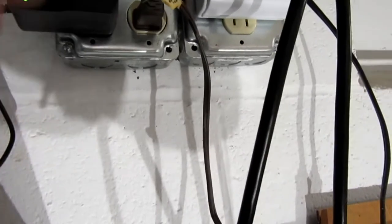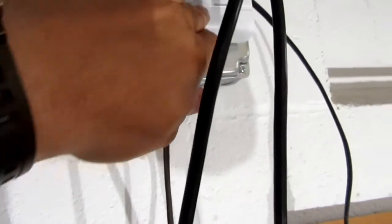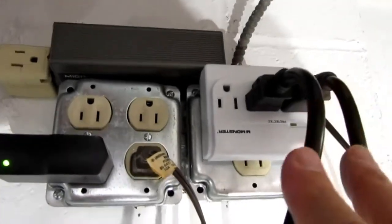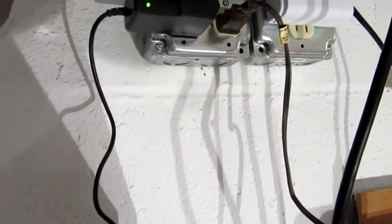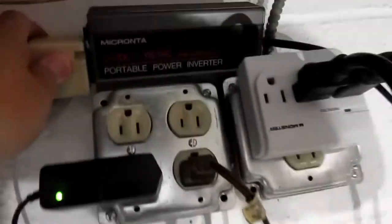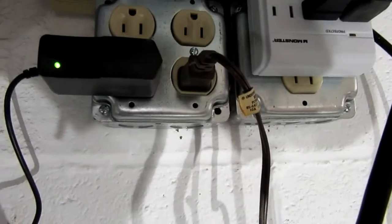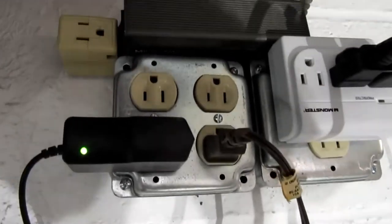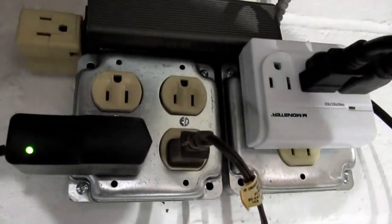They're all on the same circuit, but I've got a surge protector on there because of the solid-state nature of this Basement Watchdog and their strong recommendation that you do it. Both the primary and the Basement Watchdog pumps are plugged in there. Instead of the outlet strip, I can plug in my alarm system and my wall wart for the internet radio. And up here, I've got this ancient inverter — not a very powerful one, but I've used it a number of times when I needed power down here during a power outage and didn't want to hook up my big generator outside. I would just clip this onto the battery terminals of the Basement Watchdog and get a little AC off of there for plugging in my LED work lights or a drill or whatever I needed. It has enough capacity for that.